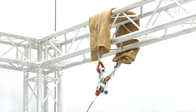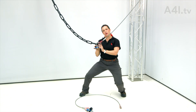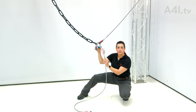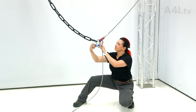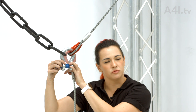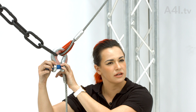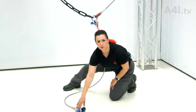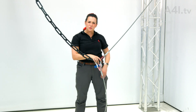Rock and roll basket, burlap on each one, bridle legs all the way to the junction shackle. We've got our wire rope drop — it just goes where the motor hook would normally go. It's almost like with each video we're just replacing where the motor hook used to be. And then all the way at the end of your wire rope drop, we connect our motor hook. Pretty straightforward.